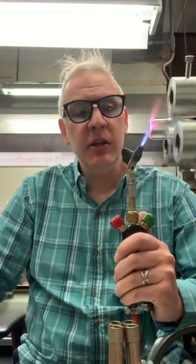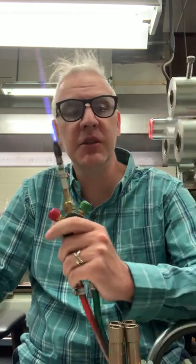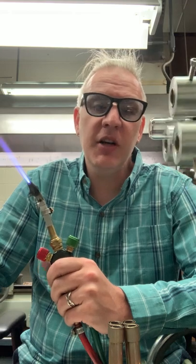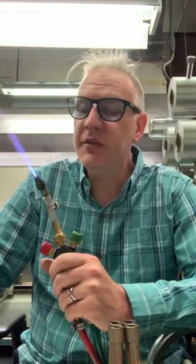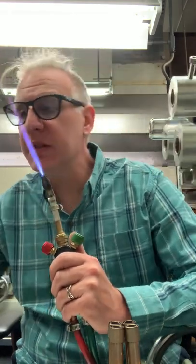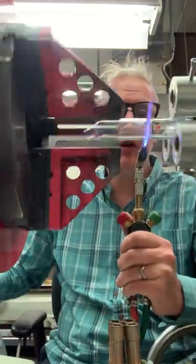This is the technique with the tweezers, it's really a feel too. You can feel how thin the glass is getting and if it's ready to cut or not. The next technique I'll do is using the tailstock, and I'll go ahead and butt seal it.